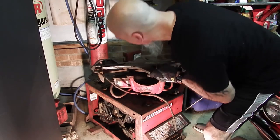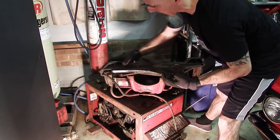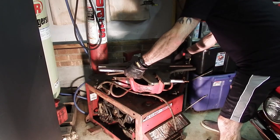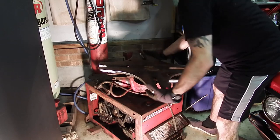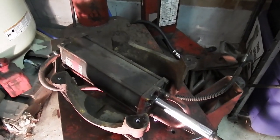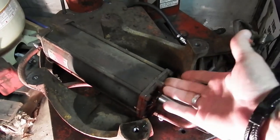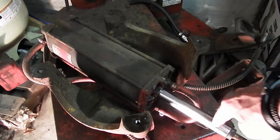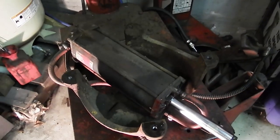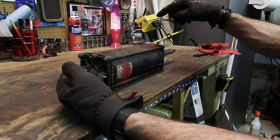Looks like this whole operation comes off together. I'm going to move this clamp — let me slide this guy off, move it over there, and this one should slide off too. With that out of the way, all I really have to do is take these two hoses off of this cylinder and then open it up. This just has four long rods like any other hydraulic or air cylinder. This will pop off and the whole shaft will come out — there's a seal inside and probably a seal here too.